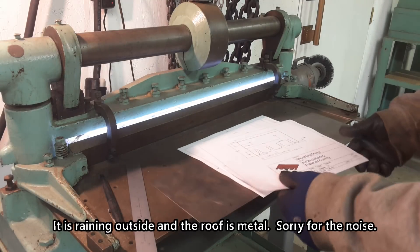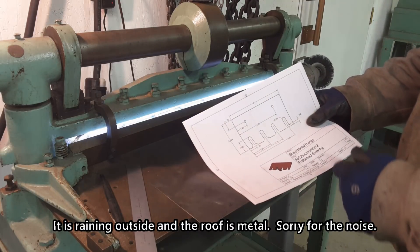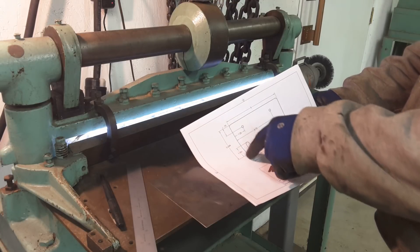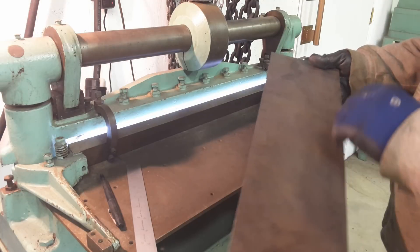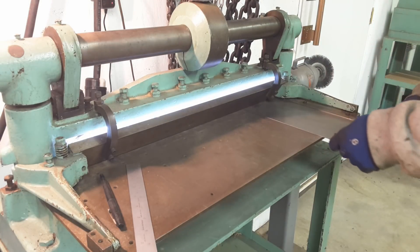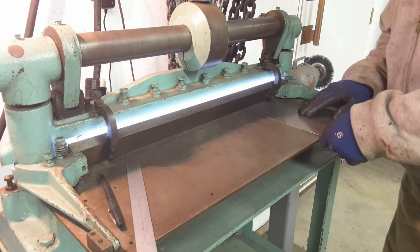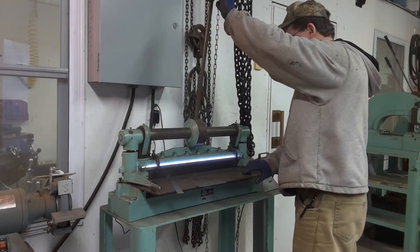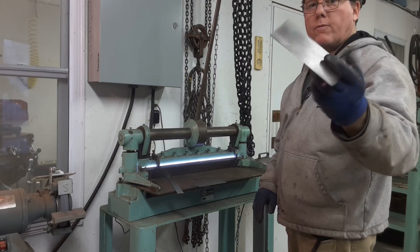So we've come out to the west bay and I brought some drawings of what we did in CAM in the last video. Basically I'm looking for some pieces that are six by three, and I'm going to round that off to three and a quarter. No exact science in this one. I've made some marks on this piece of sheet metal, so we'll put it in this manual shear here and give her a cut. And there we go — six by three and a quarter. This is our first blank.